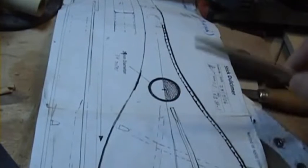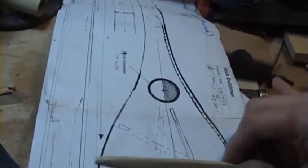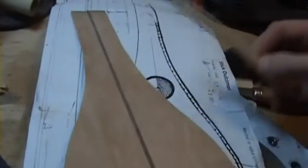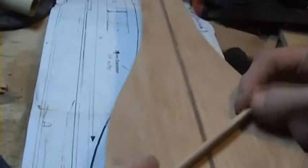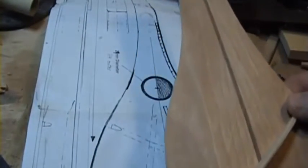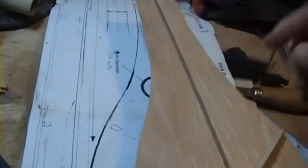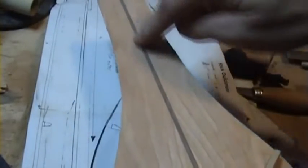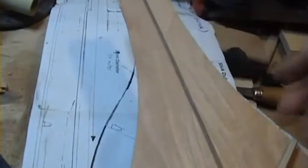If the back is very flexible, I will put one strut here at the widest point and another strut near the sound hole. But for this example, I think I'm just going to go for a single one diagonally across the bottom. And before I glue the top on, I will also put some reinforcement strips along the top, along this strip here, along with the label.